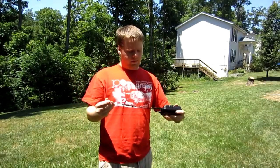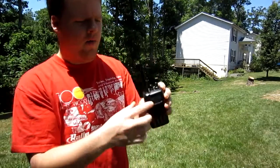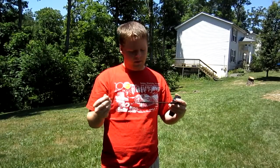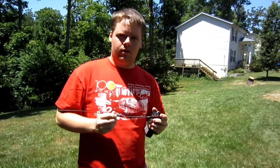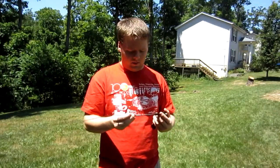So, as you saw, I made 6 or 5 satellite contacts using only a 5-watt radio, an FT60 FM transceiver, as you see here, and a literally 17-inch dual band, actually it looks like tri-band whip. It's the Diamond RH901S antenna. I got this off of Deal Extreme. Normally, they sell for about $40 on Universal Radio and Ham Radio Outlet, the other ham radio vendors online. I got this for $8 on Deal Extreme. It is not a gimmick, it is not a counterfeit antenna, it is the real thing, and it works great.